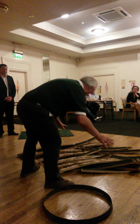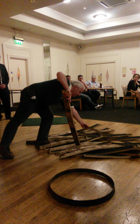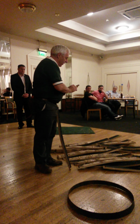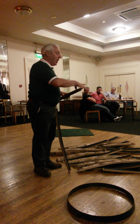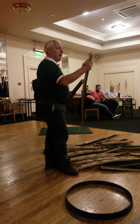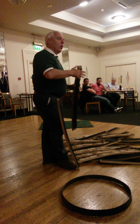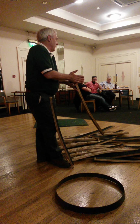And the other thing that's really difficult is the angle that's on the stave here, the fall. You can't see it now in one of these small casks, but that angle changes with the width of every single stave. So if I have a thin, narrow stave, it's very small. It's not much of an angle. It's almost flat. And the wider I go, the more of a fall I get. The only way I judge that is by eye. I have no tool to correct it.